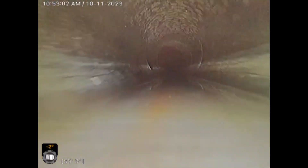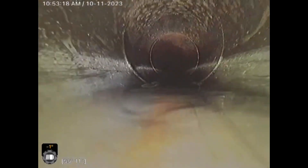It looks like there's a clean out right here. I want to see if I can find that. Okay, we found it — it looks like there is some type of clean out and it looks to be under some of the pavers. We're going to recommend we expose that. It's a possibility that it might be a two-way clean out, simply because there's no other connections — just this glue joint here and the glue joint there, nothing else. And you can barely see around 12 o'clock there's another opening — that's how I know it's a two-way clean out, and again that's under the pavers.